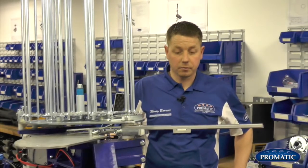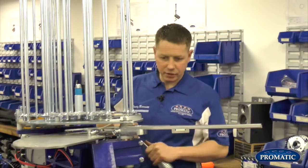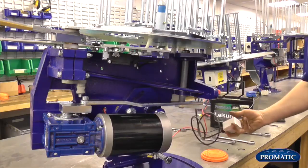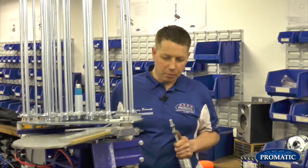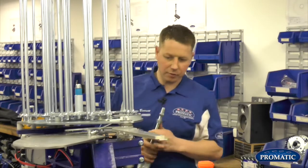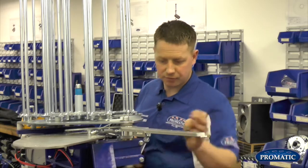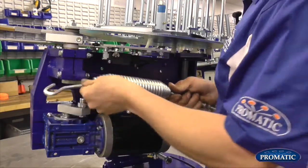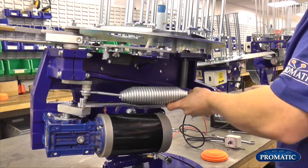So we're now finally putting the trap back together, so the last piece to go on is the spring. When we come to put the spring back on, this is what a lot of people tend not to understand: how to take the spring off correctly, or more importantly, put the spring back on. If we nudge this round now, we bring it down there, we bring him back into the 6 o'clock position with the crank, so the arm is sticking straight out towards you, as you can see, it's straight out towards you. So with the hook eye facing in, like so, and that's off the back.